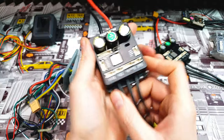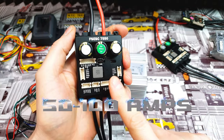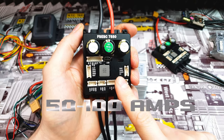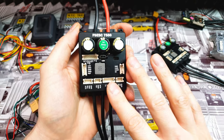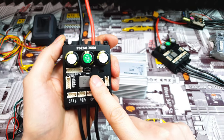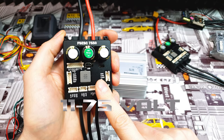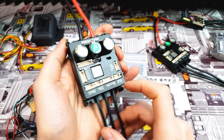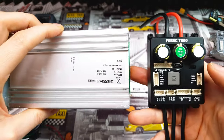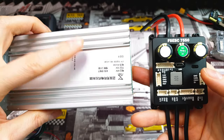But it doesn't mean it's less powerful. This thing can handle up to 50 amps constant and over 100 amps peak. And that could be true, because all VESCs are quite powerful. Also this one can handle from 3S to 16S, so up to around 75 volts — it's like a pocket beast.